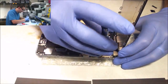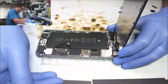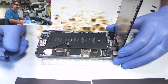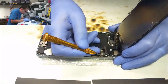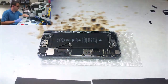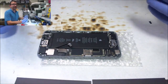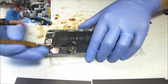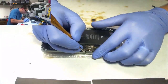So the other one that came back, no matter what touch ICs were changed and no matter what you did, this phone always has somewhat of a finicky touch issue. It's really weird. Once in a great while, after I'm all done with it, the touch screen would still quit working. And you could trigger that by bending the phone really hard. So that phone, I wound up doing the iPad rehab, the Minden iPad rehab, future shield on it, and it fixed it. It hasn't come back. So either they're tired of bringing it back, or it did only come back once, or it's fixed. I'm pretty sure it is fixed, because after I did that, I wasn't able to get it to mess up no matter how hard I bent the phone.